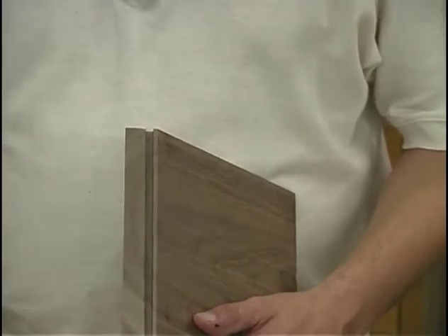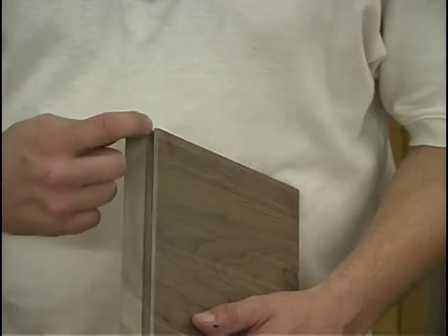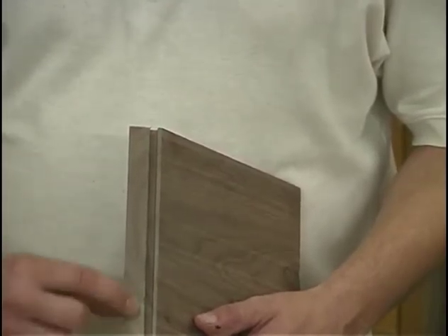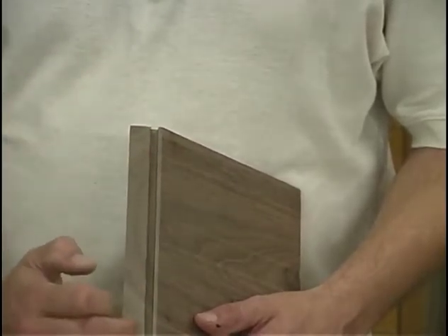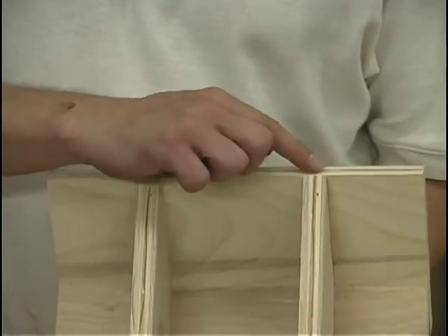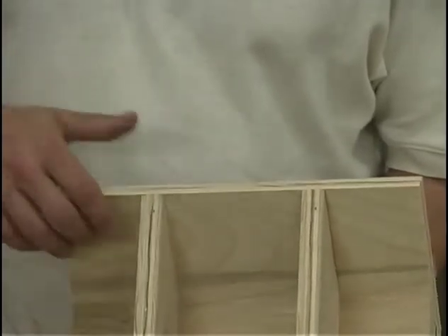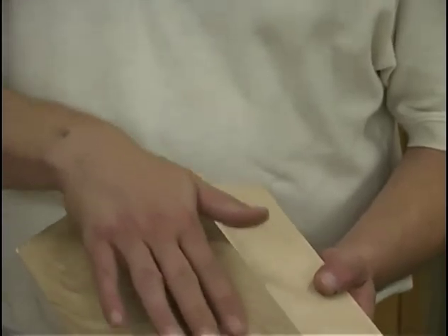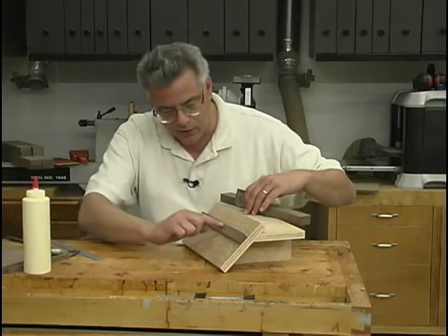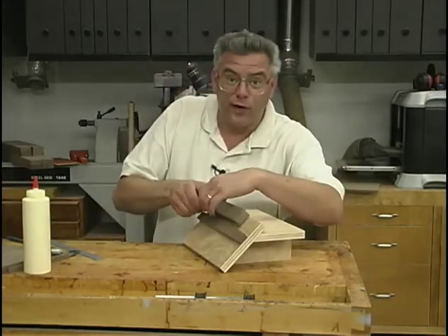My test cut is showing that I've got an error in my angle — I'm actually a little bit wider at one end than the other. It turns out it's a little bit more than a 32nd of an inch, which is quite a bit. I need to make an adjustment to the jig because we do need that slot to run as perfectly parallel as we can along this surface. What I ended up goofing up on — even though I used a stop block along the surface when I put the gussets in — one is standing proud of the surface a little bit and one is back a little bit, creating enough angle to cause that 30 or 40 thousandths of error. So now I need to correct that with a little bit of hand sanding to take that angle out of the tool guide. I've made a layout mark and now it's just a matter of some very careful sanding and fitting.